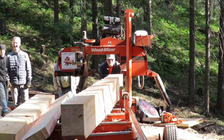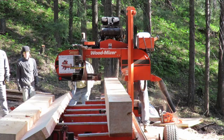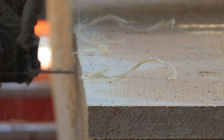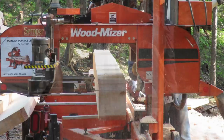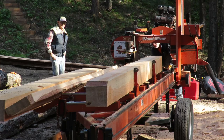Move that guy over, start knocking it down, put your weight into it. You can see we're getting mostly rift sawn, with some quarter sawn in there. Right out on the edge near the operator side you might want to trim that off if you don't want grain that's really fairly rift sawn. But you can see that grain is starting to stand up nicely, except for right on the edge, and that can be trimmed off. We're getting down deep enough that it's time to roll it over. It's also time to get some water — big cuts, big logs, you really start pouring the water on. We're going to roll it around a little bit, get it to where I like the way the grain's sitting, and call it a night.